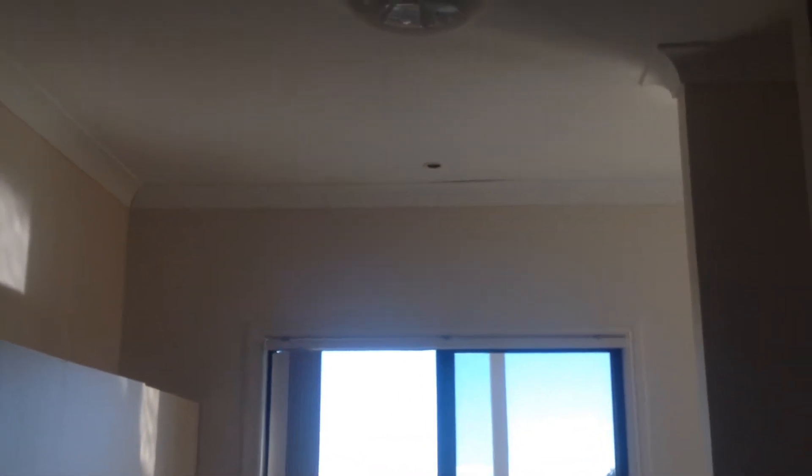Now have a look out in the kitchen — I just want to quickly show you out here. You can see the ceilings are gone up here. That's just because the load shifted on the trusses when we moved them and everything's gone back and loaded where it should be. When we adjust these trusses now, it's probably going to crack it a bit more, so we'll keep our eye on it.